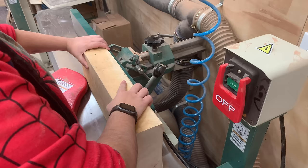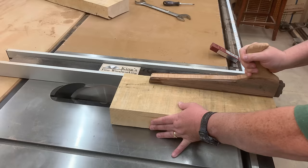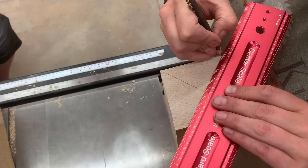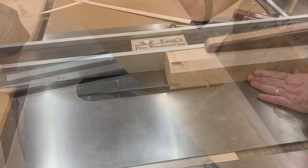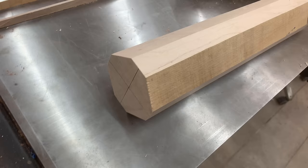As the tool gets larger, the more likely you are to have tear-out in the threads. And if the threads start to tear out, they're not going to be very strong and they're not going to be very pretty. There are a great variety of wooden thread making kits on the market today, and they're all fairly economical — anywhere from $25 to $50 or so a piece until you get very large in size. For the most part, as woodworkers, we don't often need anything bigger than maybe an inch and a half.